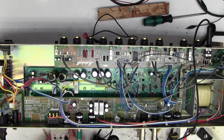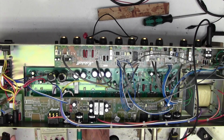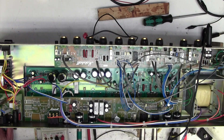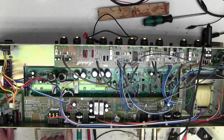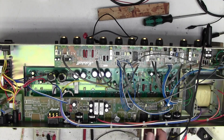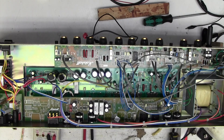I've put a new HT fuse in and you can hear the amp's working - that's the tone going through it. I'm just going to check the bias. Make sure it's not - ah yes, okay - one of the tubes is red plating there. Hello folks and welcome to idiot land. I forgot to plug in the plug from this little backboard when we took it out. I unplugged it and then I took the board out - I forgot to plug it back in at this end. The tubes are not getting any bias, which caused one of them to temporarily red plate and take the HT fuse out.